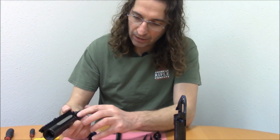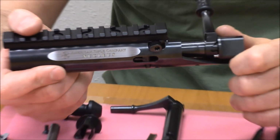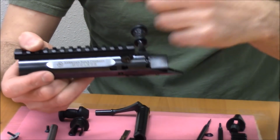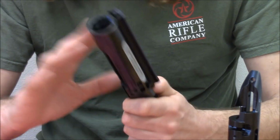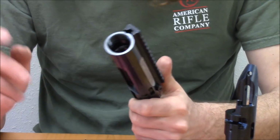The mechanical ejector, or inertial ejector, is driven by the inertia of the rearward moving bolt. I don't know if you can see that there. It's a passive system, just like that of the Mauser and the 1903 Springfield. What else do we have? Mechanical check. Bolt stop, I already went over the bolt stop briefly, right? You just flip it over. It uses AICS pattern magazines. No AIAW. Sorry folks, couldn't really get them to work in this thing.